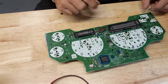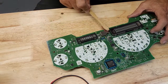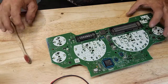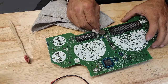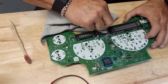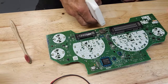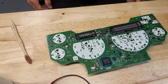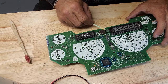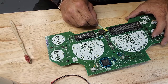We do have more of these when they burn themselves up — they do burn themselves up. This one was nice and fresh in its failure so we didn't have to replace it. You can find that part on Mouser. It's important to get your flux cleaned off of there because it will kind of eat up some traces itself — get that stuff off, it's done its job.